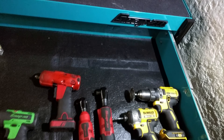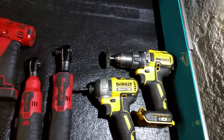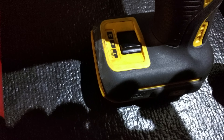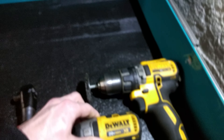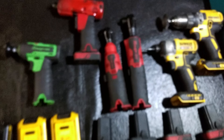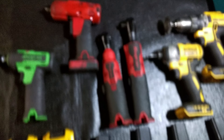I've got all my power tools on this side and all the air tools on this side, though this will change once I get the socket rails. These are just the brushless DeWalt 20-volt XR. This one's nice — it's the newer model with the precision screw mode, which reduces torque. It stops completely and then gives you individual impacts, kind of tut-tut-tut, so you can control the torque pretty well.